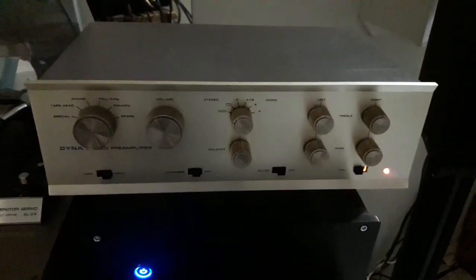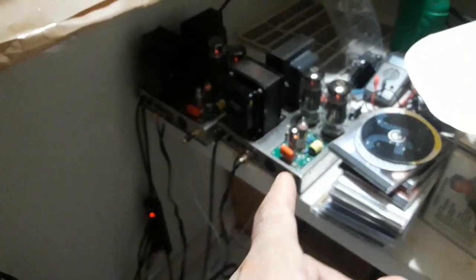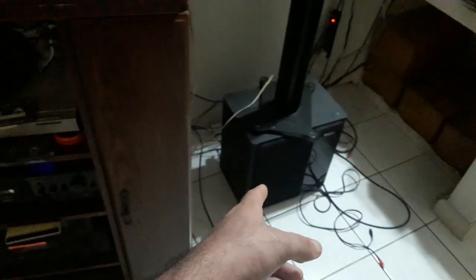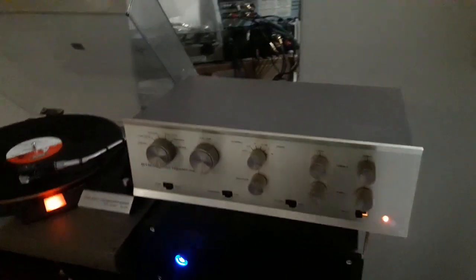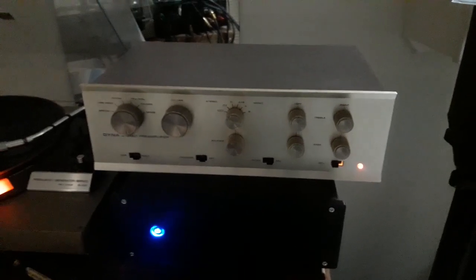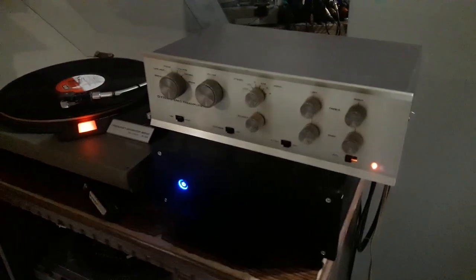Okay folks, things have gone well. I've just stacked it here temporarily on top of the EAR clone. And I kind of ratched a bit. I had to do a bit of a splitter to send the signal out from this to my Dynaco Mark IIIs, which are driving these Acoustic Energies. I also sent it to a rack mount amp, which drives those subs. It's not ideal. I have some mods to do. Probably put in an external unit to properly split those signals without messing up each other's impedances.